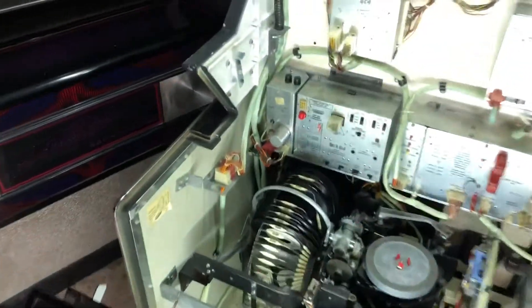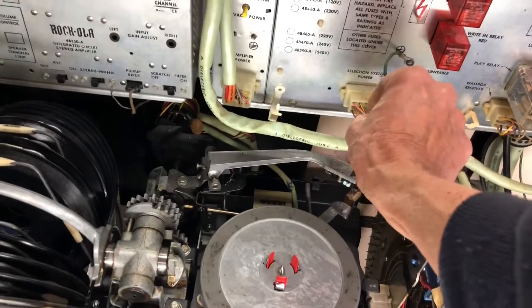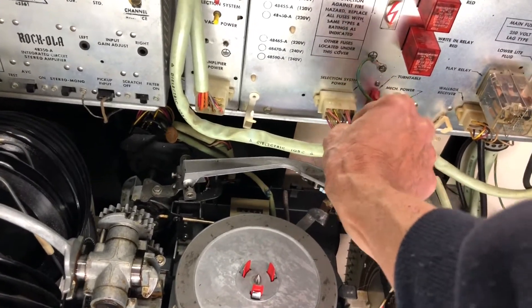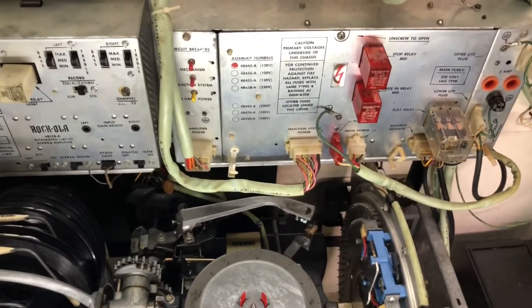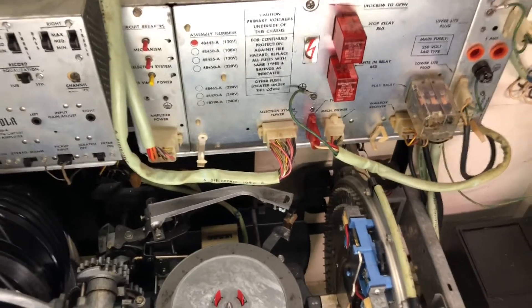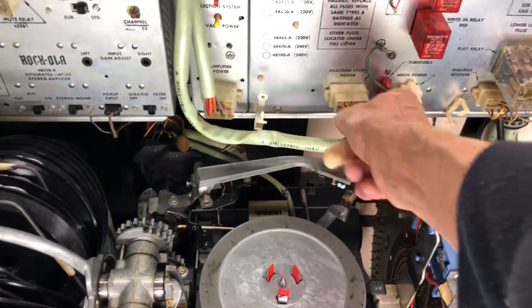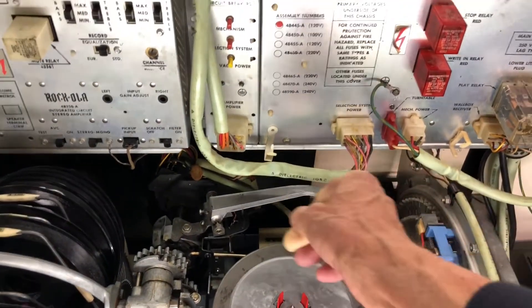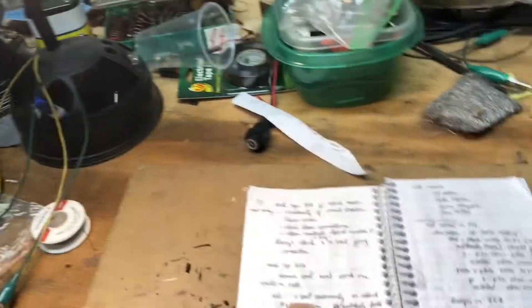The problem is you have to do a meticulous search for dirty loose connections — that's still public enemy number one. In my case it turned out I re-seated the connectors twice; the second time I got it to work. Also, take your forceps and pull on all the wires at some of these connectors — you'd be amazed, every once in a while one comes right out and you realize the wire was loose all along. Loose connections and dirty contacts are your enemy.